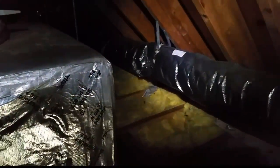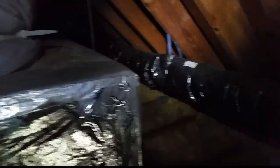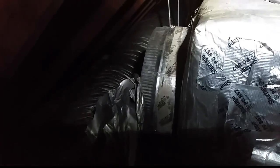The flex already has a tear in it right there, and the flex over here also has a tear in it, so it's a real junk heap here. I don't have stuff to repair or replace it right now, so I'm going to hook this up just to test the unit and notify the homeowner — he'll probably replace these flexes. Someone added one at some point. But this is that old jacket — getting old, it starts crumbling and falling apart, getting real brittle. Be very careful when reattaching.